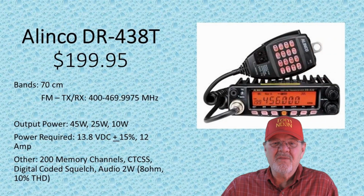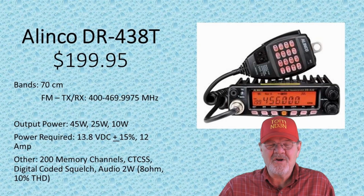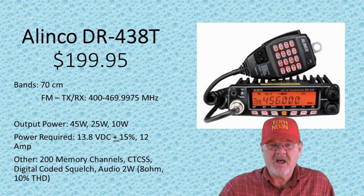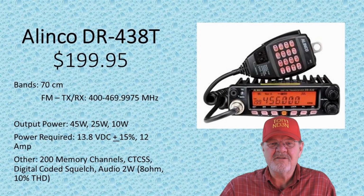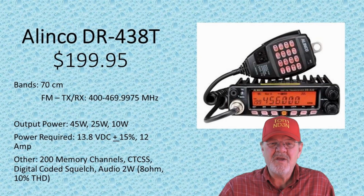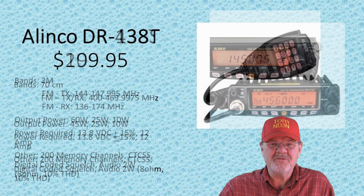The Alinco DR-438T is the 70 centimeter or 440 band version of the DR-138T, the 2-meter that we just discussed. It also costs $199.95 and transmits FM from 400 to 470 megahertz. The output power is 45, 25, or 10 watts. Just like its 2-meter counterpart, it requires 12 amps when using full power. It has 200 memory channels and an audio output of 2 watts into 8 ohms.